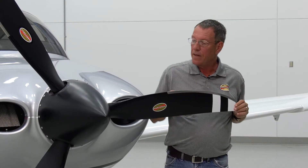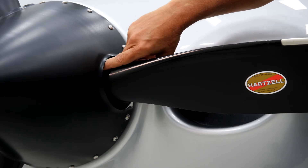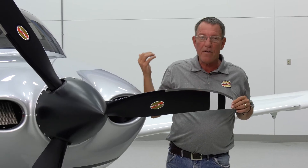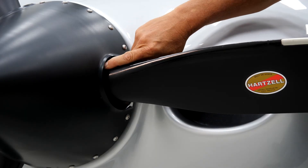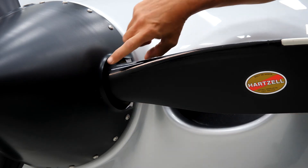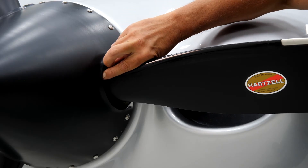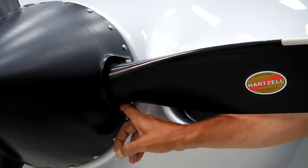The next item to check is the interior of the spinner, looking for grease or oil leakage or loose material. Some grease or oil may be present but it shouldn't be excessive. Grease or oil that travels down the length of the blade or spatters up on the windscreen during operation is not acceptable, but a small amount is fairly normal. Use a strong light source and look inside the opening of the spinner. If you have a de-ice system installed, make sure the clamps and wires are properly secured. Also check that any balance weights and their hardware have not loosened and remain in place.